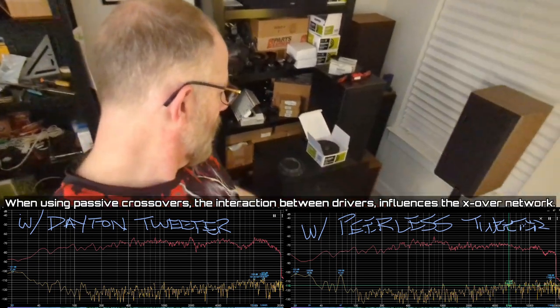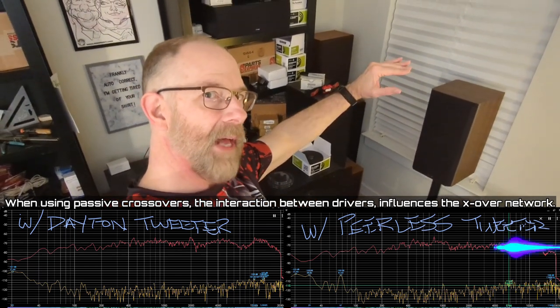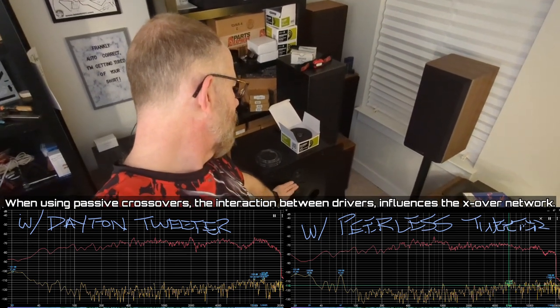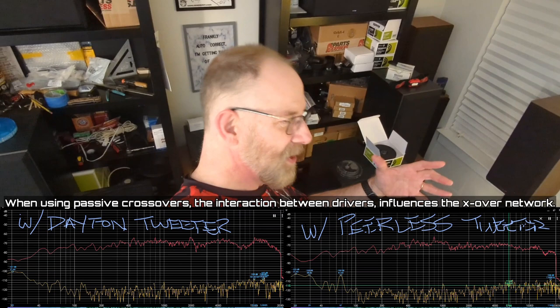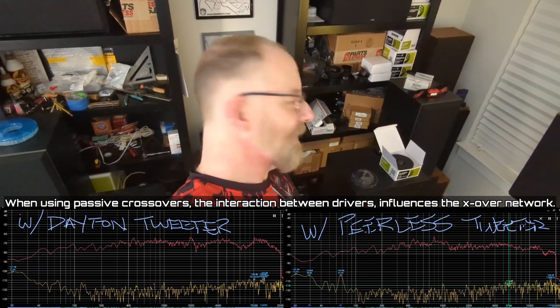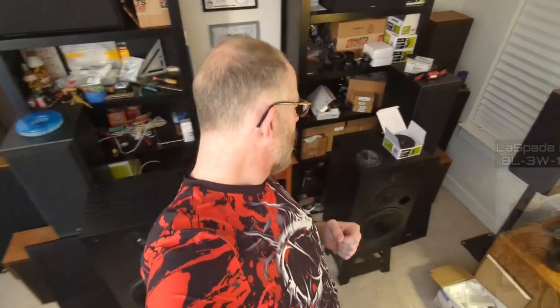This one here, the tweeter actually has a better, flatter frequency response, but it kind of messes with the frequency response of the Dayton reference mid-range. So that's to be expected. You're mixing and matching the different impedances and their varying resistances as they go against that crossover, which, if this is your first time watching, what I have inside of here is an old La Spada crossover. It's just an off-the-shelf crossover, so it's just designed for an 8-ohm load.